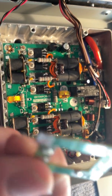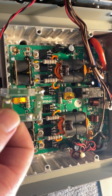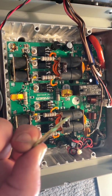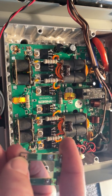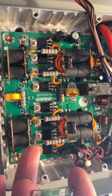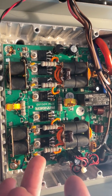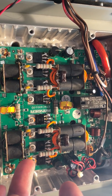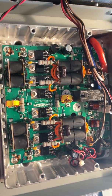By removing this board, it removed a lot of the harmonics and spurious emissions. The resistors are the same — that's what was on this board — but it had a surface-mount capacitor, and I changed that with 104s, a little bit higher kV rating than what was there. So the resistors are the same, but I just changed out the 104s on the feedback circuit, and that's about it.